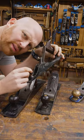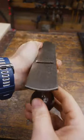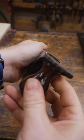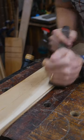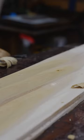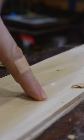What's a scrub plane? A scrub plane is usually a rather narrow plane with a very heavy cambered iron that sticks out almost an eighth of an inch. It's designed to take off very large amounts of material very quickly. You can see how it leaves these large scallops in here — some of them are almost an eighth inch deep in the middle.